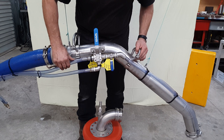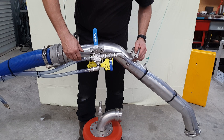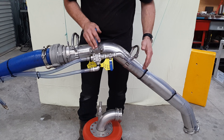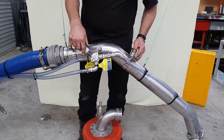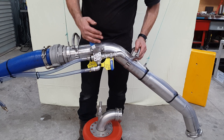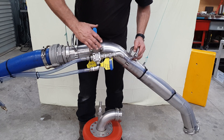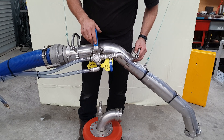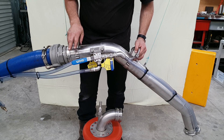What it uses hydraulically uses water — there's no oil hydraulics or topside hydraulics needed to operate the reversal valve, which is quite handy. So everything is in control with the diver. The diver can in effect turn the dredge on and off halfway if they like by altering the amount of water that goes to the reversal valve. Alter that through there, it puts the reversal valve on, flows backward, back flushes the dredge and away you go. Then you can turn that back on and continue operating as normal.